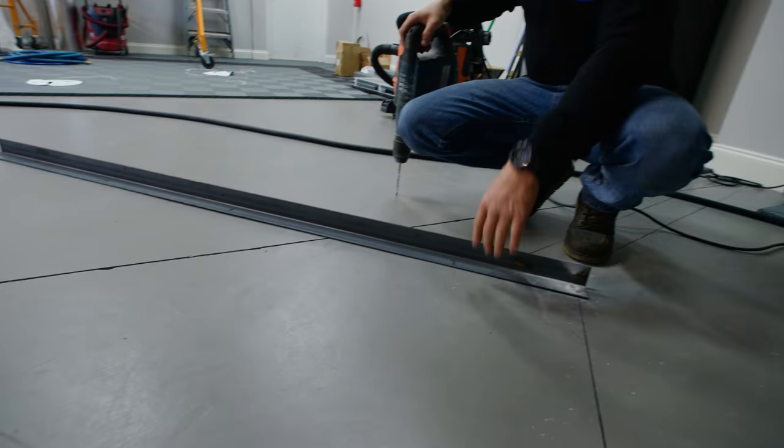And then I use a couple of shackles or clevises on the end of this strap. And basically use the forklift. I try to pull up on this end first because we haven't cut all the way through in the corner. So what we want to do is fracture it, and then this piece should just lift straight up and out. So I'll show you how I'm doing that.